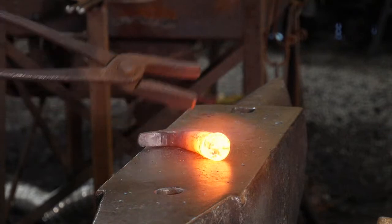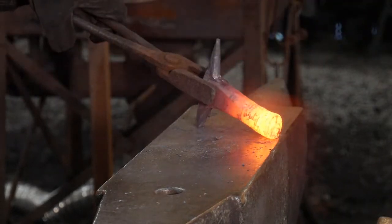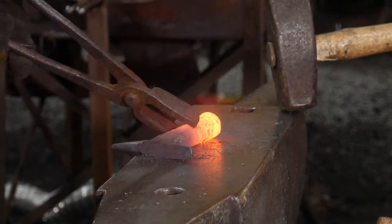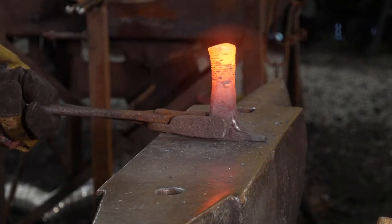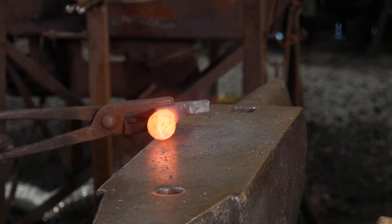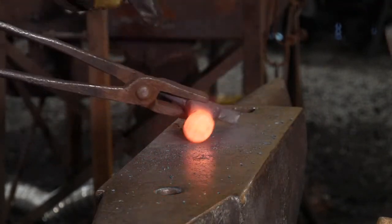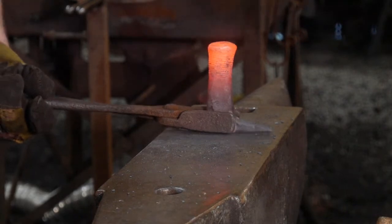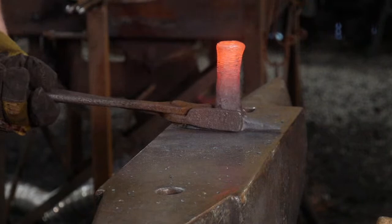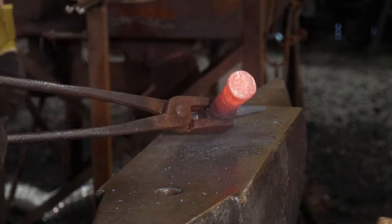Well, starting to get out of order there. Hit it right here. We got that high side to work. So we want to do controlled upsetting. See how we're developing a high side there? You need to drive back into the body, just like we were hammering out a rhombus. Not right on it. You want to drive back here towards the core of the material. Too much angle. Flatten out. There you go. Okay, we'll need to get it hot again, and we're going to push it a bit more when we come out again.